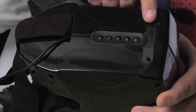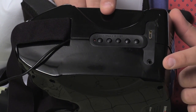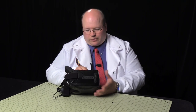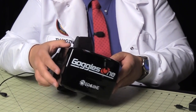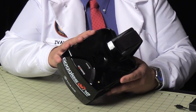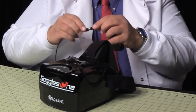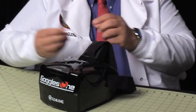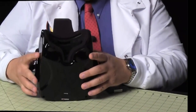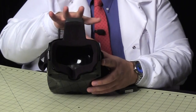There's a little trap door here — that's the HDMI input — and below that is a headphone output. If you're doing something which has audio through HDMI, you plug in headphones at the bottom to listen to it, and it works pretty good. The only other thing of note is that there is a small fan located in this little vent here — it pulls air from the bottom straight through the top so it won't overheat in the sun. The battery just plugs right in. As for the antenna, I probably won't be using the stock one. It's also got a Fresnel lens in there, and as far as I can tell it cannot be focused or moved, so it's a fixed focus.